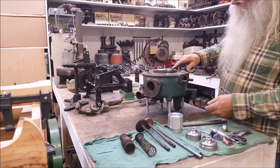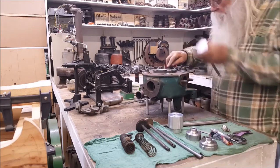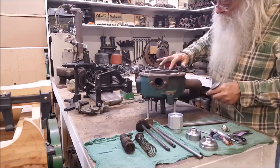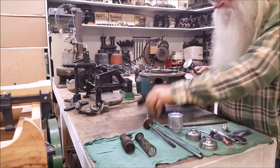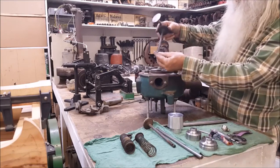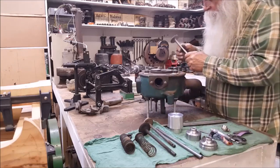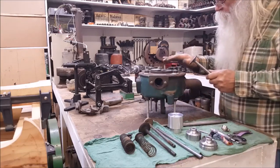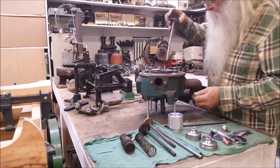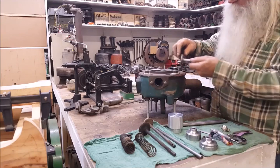Well, the exhaust is going to be too little once you cut the seat in there, because this seat down here is mushroomed out so much on this side over here where that gas has been. It was sideways in there, wore this side over here crooked, and it wore away there. It's not straight, it's crowned up. So we have to cut that seat to fit.